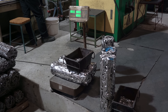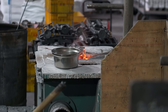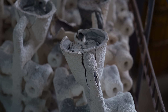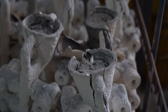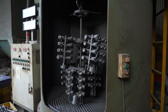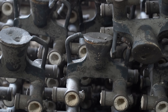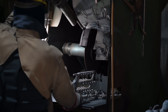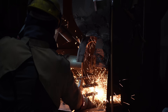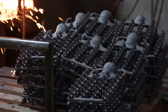Here's the raw material before it's melted — notice the mixture of scrap metal and new metal. After casting, the molds are all cracked due to the massive temperature changes. Don't worry — the molds need to be broken to remove the parts anyway. The next step is to remove the ceramic mold: a combination of giant shakers and sandblasting is used to remove all the ceramic from the parts. Finally, parts must be individually removed from the tree. This may look tedious and dangerous, and that's because it is. This visit helped me appreciate all the work that goes into a simple $15 cast dropout.